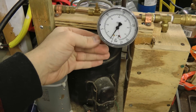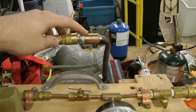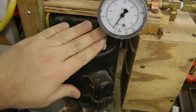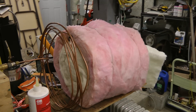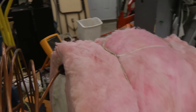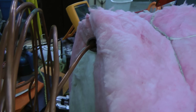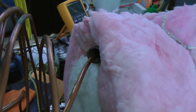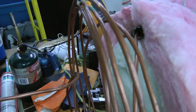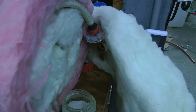This compressor also stayed reasonably cool during that run, so I think as long as you feed it with a decent supply of air at a good pressure, the compressor stays relatively happy. That was a pretty successful run. Looks like I'm going to have to make the recuperator much longer, because we basically need to get the delta T between the outgoing air and the incoming air to be much smaller than the delta T produced by the expansion cooling of the gas — the Joule-Thomson cooling.